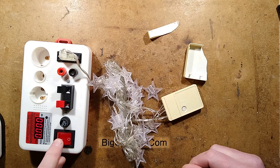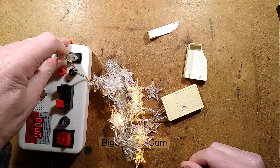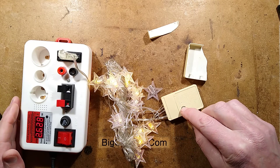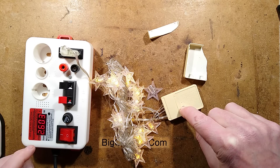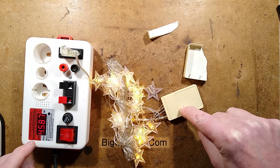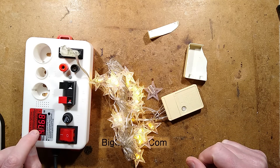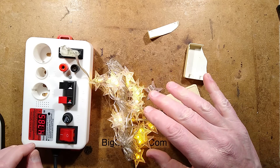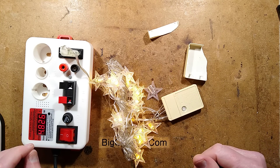Oops, there's another cap falling off, and I turn it on. Not making a great connection. It's drawing about 2.6 watts, but set up to the static mode it draws about 4.7 watts, which means roughly 2.5 watts has been dissipated across each section, most of it across the resistors.